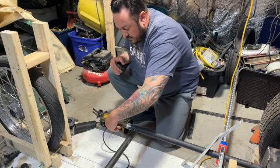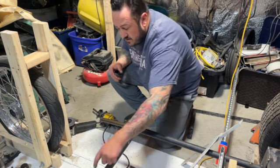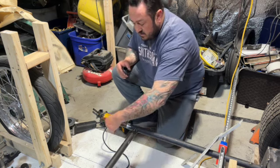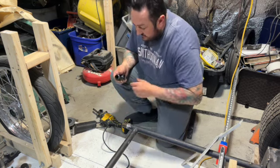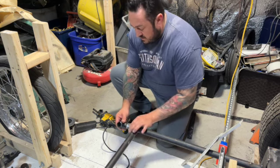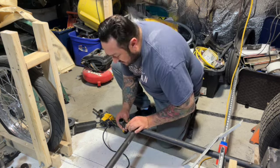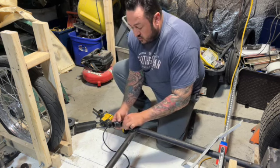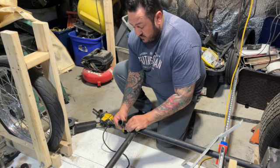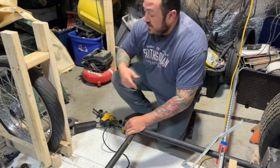There's a little bit of movement, but I'm gonna drill a couple holes here for a rosette. Here, I'll go straight through, so I have one on top, one on the bottom. Make a small piece, so maybe that much is coming out, we'll say. And then slide this back to here, just so we get that 90, so we have something in there holding this joint other than just me butt welding these two together. Then we'll angle that one up, put some small pieces.